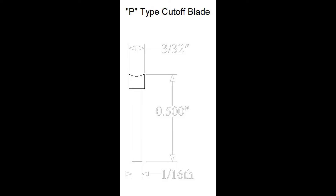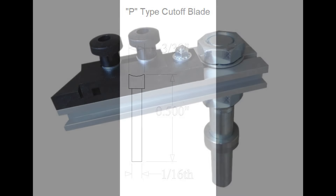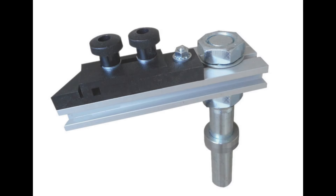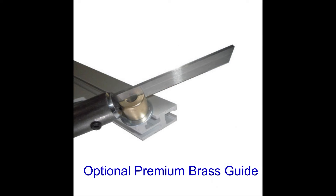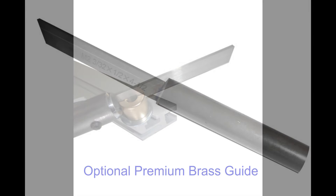You will not need to wiggle this parting tool as you would with any other normal parting tool for clearance. Push it straight into the work at a moderate rate, letting the tool do the work. You may choose to pull it back to clear shavings, but you shouldn't have to do that very often.